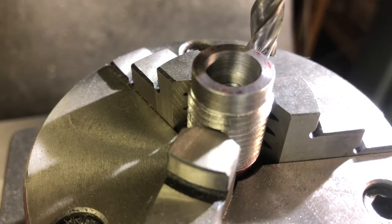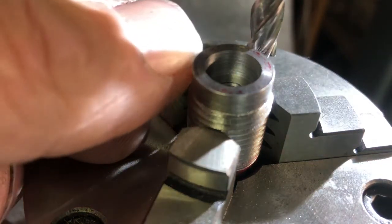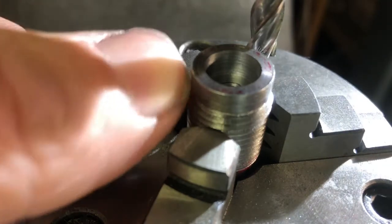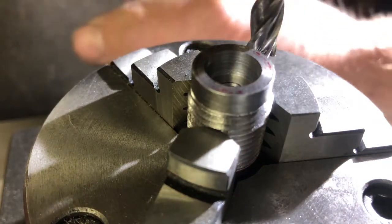I'm going to kick the mill on. We're taking, let's see, we're 577, and on the outer portion of this around the edge, and we're going to 500. So 77 divided by 2 is 37, 38 and a half. So that might be a little too much. We'll do it in two passes. So right now the table is at 1.782. Write that number right here on the back of the vise.